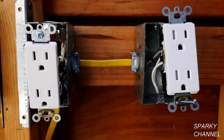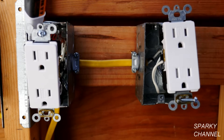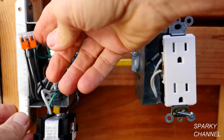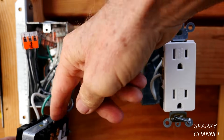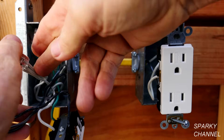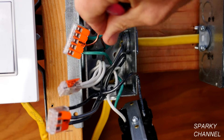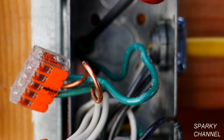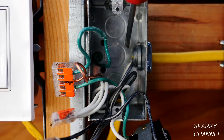I've now loosened up this receptacle and I'm going to test with my voltage detector in the back of the box to make sure there are no live wires — and there are none. Here we have the hot wires: one coming from the power source, one going to the next receptacle, and one going to the receptacle itself. The neutral is the same situation with three wires. Here we have the grounds: one green wire going to the receptacle, one bare ground wire coming in from the power source, and one grounding pigtail — called the equipment grounding conductor in the code book. There is no ground wire in the cable going to the next receptacle. That's the problem.